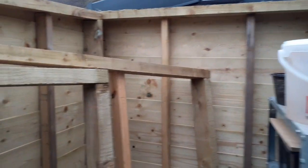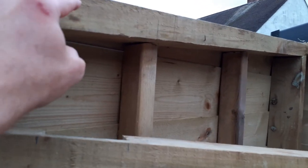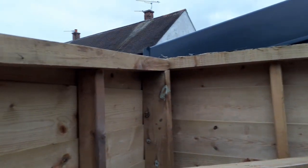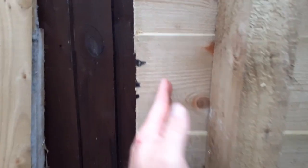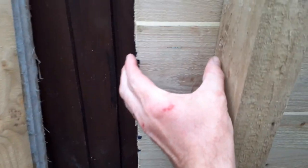The roof shouldn't take too long — just needs the plywood cut, felt it, and get it on. What I'm going to do is an inner frame so I can screw into this. As you can see there's the slope on top — there's a four inch difference — and the reason the feather edge hangs over is because once this goes on there it will butt up.